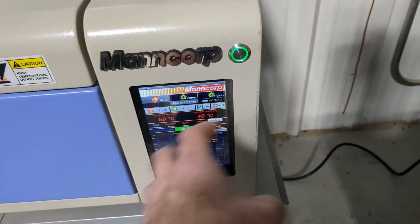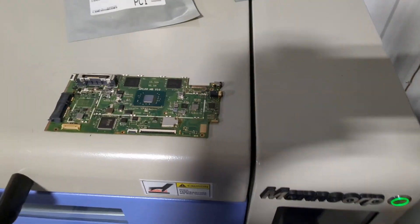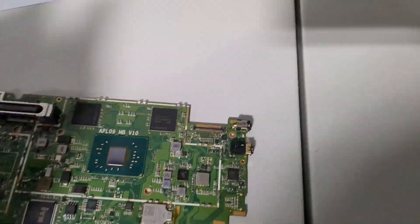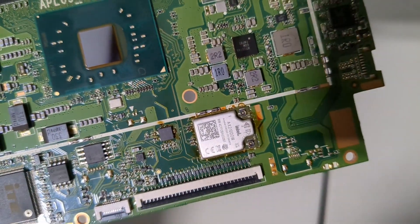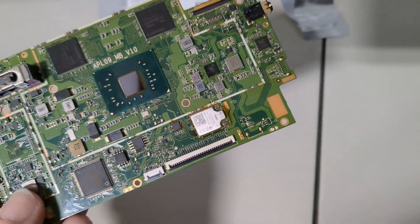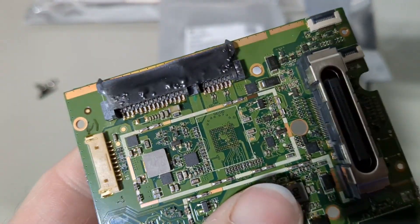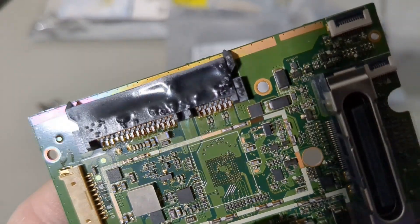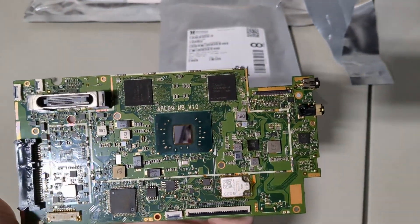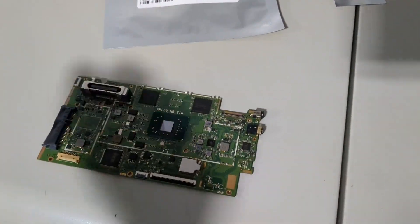It runs in kiosk mode, so you're kind of stuck with that — that's how they designed this machine. I learned a couple of things here. The solder is all soldered down. But more importantly, the reflow profile stored in this machine is too hot for this board, because the SATA connector did not survive. That's a reflow-style connector. My thought is that the lead-free profile that shot up to like 250°C is not the right one for this board.